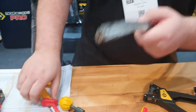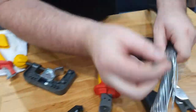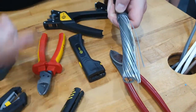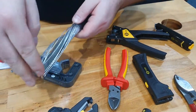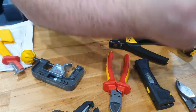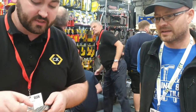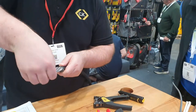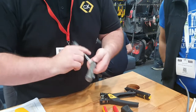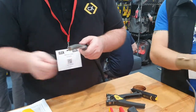There you go. And now what we're going to do is grab one of these armour strands and just begin pulling backwards and forwards, or just fold away like that. You do armoured cable quite often? I do, unfortunately, yes. Which method do you use? Do you use the armour slice? Do you use a hacksaw? Oh, I use the armour slice every time. Really quick, really easy. No hard work. No, I did use a hacksaw once and I've got the scar to show it.